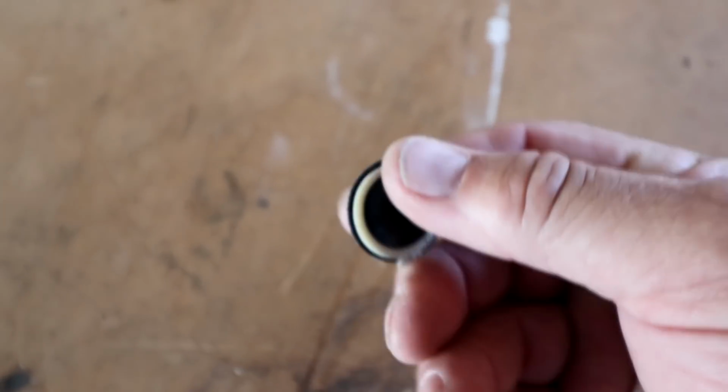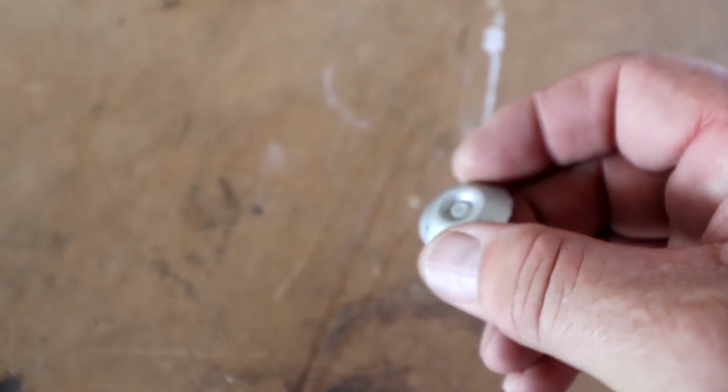All right, so in the roof there were these little grommets, and you pop the grommet off, and underneath there's a bolt that's in the frame, in the cross members of the ceiling. Those are factory mounting positions for things like ladder racks and whatnot. So I put one there, and there's a second one, and then a third, and there's 4 of them. They run down the side of the van. I put this track on here, and it's almost like a ladder rack in itself, but it sits really low to the ground. It's not up in the air real high, and it mounted these things perfectly.